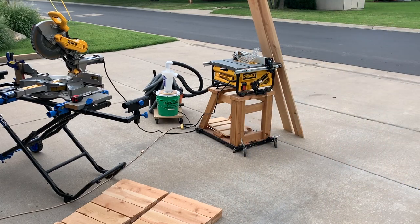I'm gonna rip two different widths here. If you don't have a table saw and don't want to do this part, you can just get some inch-and-a-half or two-inch wide strips of cedar for the corners — they sell those at the hardware store or lumber yard. I'm going to do some strips at two inches wide and some strips at an inch and a half wide, since they'll be overlapped in the corner. I'll explain that more as we assemble. I'm going to put on my respirator because the cedar really bugs my sinuses.